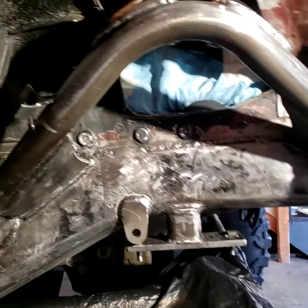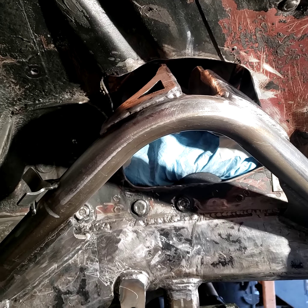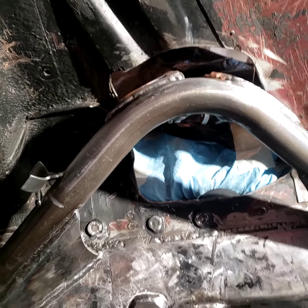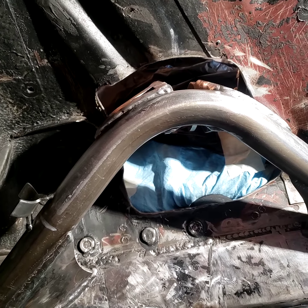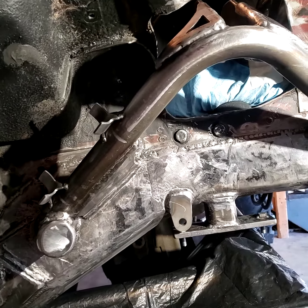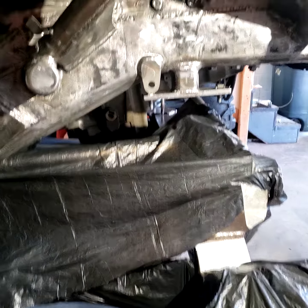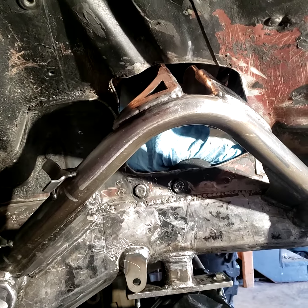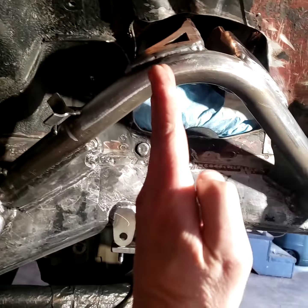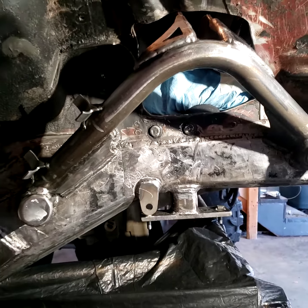Once it's plated, where the stock coil mounts are, you trace around the outside and cut out just that opening — that's where you'll poke up through with your mount. Then figure out where your axle is going to be. You can have your shocks leaned at a slight angle forward or back; I lean mine back a little, maybe seven or eight degrees.